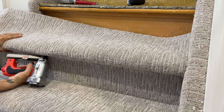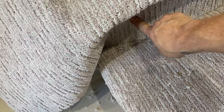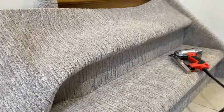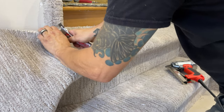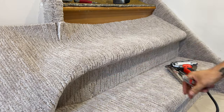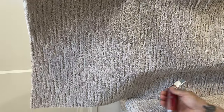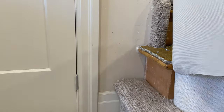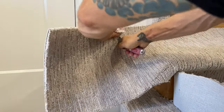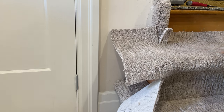You can put one staple in — sometimes I like to put two — and I'll do that all the way to the end of the stair, right where it turns and bends over to the other side. I'm going to kick that in, but first I need to make a release cut around the stringer on both sides. Now that I have this wrapped, I can cut on that 45 at the wire staple to get rid of the bulk. There's the tail — that'll wrap around in there. Pull that tail back a little, get rid of the bulk, and now we're in business.